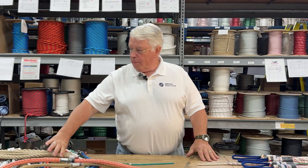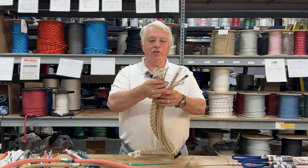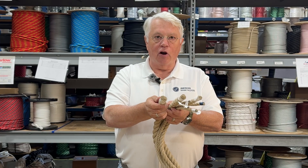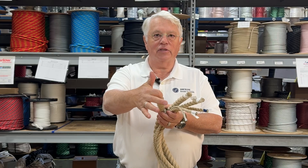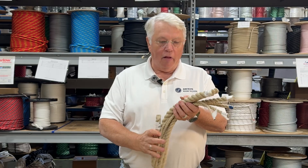The core of a line is the internal structure of the line. Many years ago when line first started being made and it was stranded together — as in three strands — it didn't have a core, because the outside wrapping of the line, the fibers, yarns, and strands around itself, didn't need one. But then as they needed more strength, they went to a four or five strand, and at that point they had to put something inside to give it the round structure. And so we call that the core.